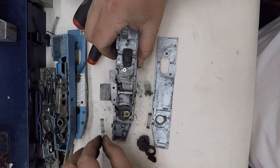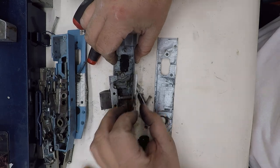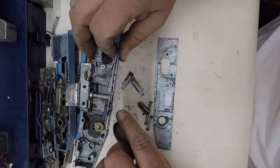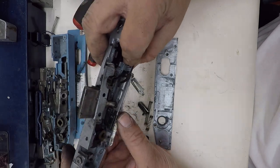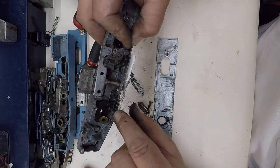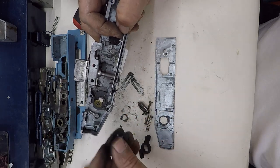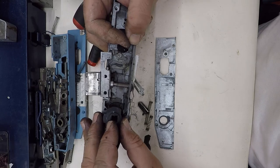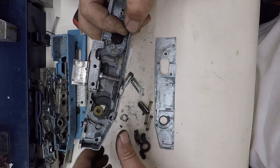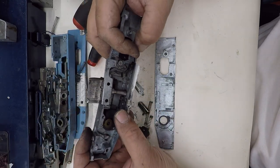Anyway, that is the mystery — something to do with the secondary that's played up. When we change these little allen keys on this side, you can see what they are — they're just basically little triangles. They slide behind this mechanism here, preventing it from turning. That round part here: when this is down it will actually block it so it can't turn, and when it's lifted out of the way it allows it to rotate. As you can see, they're offset — so one side's good and one side won't be allowed to work.